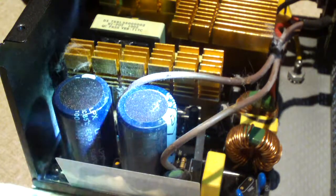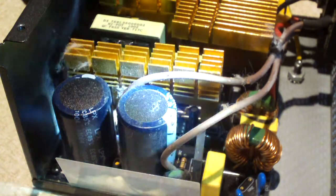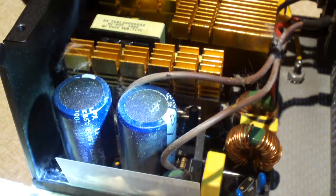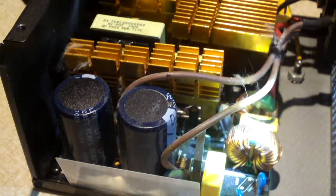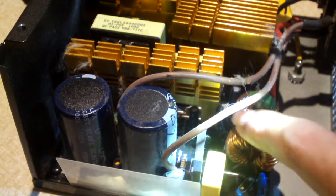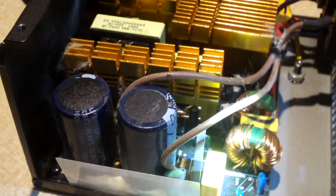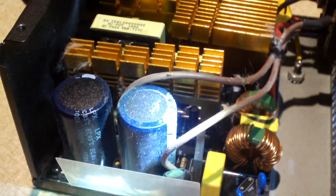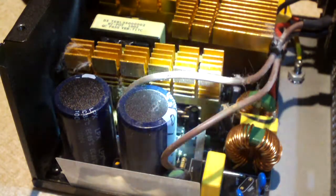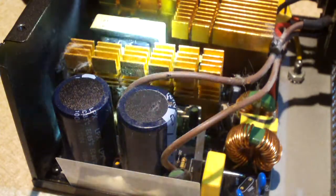You've got to think about it — many homes have circuit breakers for a particular room rated at about 15 amps. This power supply does have a fuse, right there. I may have to test that fuse. Hopefully it actually worked, but according to what the man said, apparently the fuse did not do its job. I tested the fuse on a multimeter and despite the fact that this power supply kicked the main circuit breaker in the house, that fuse is still good.